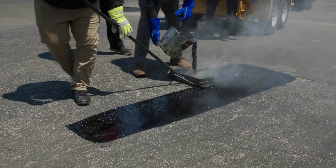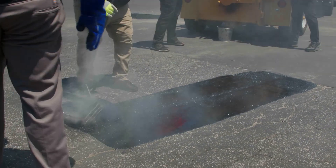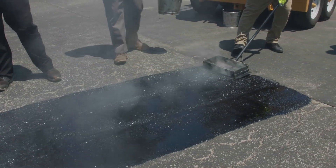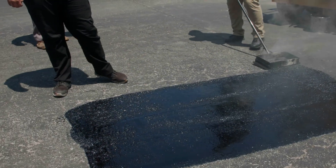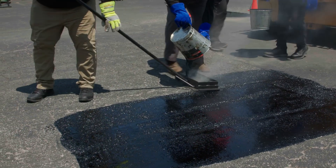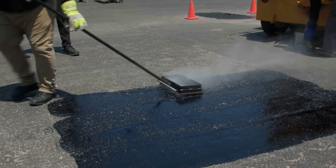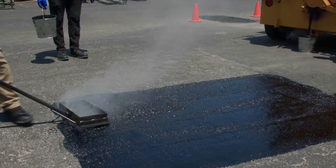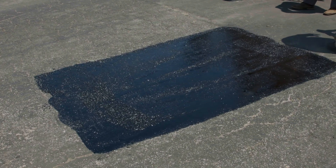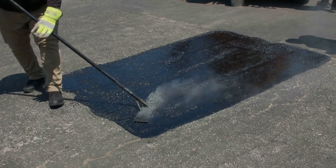If you have to reposition with the box, you're going to want to overlap on top of the old material you just laid down to prevent any high spots. One important thing to remember when using this on alligated areas is you want to try and get the mastic to sound pavement. After you're done with the drag box, use your flat iron to level out any high spots and make a uniform finish.